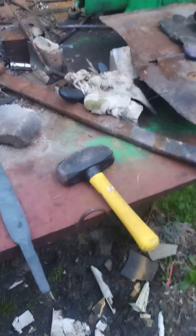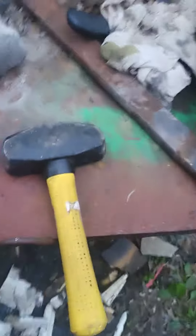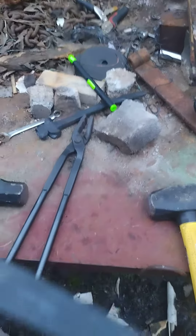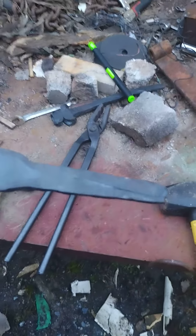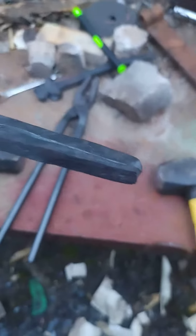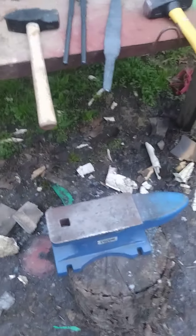The four pound I use mostly. If I've got something like right here on this handle — that's what they normally call a forge weld, but that is actually where I folded the steel. Now that'll grind right out. But if it's been down here in the blade, I would take that four pound, hold it steady on my old anvil here, and beat the living tar out of it until it's flattened out.